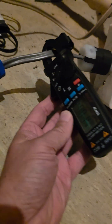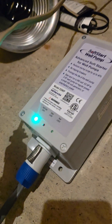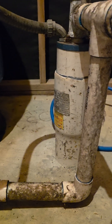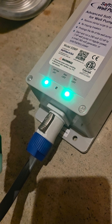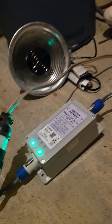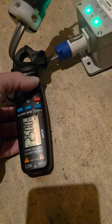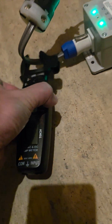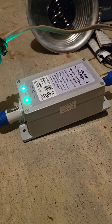The clamp meter is giving me a rough time over here, but hopefully in just a second — the well pump just kicked on and you can see that the run LED is on. It is pulling into this system here and it barely pulls anything. Again, this is just a really super handy way to soften that heavy start of your well.